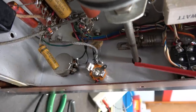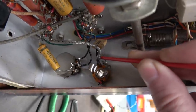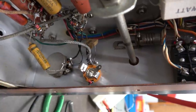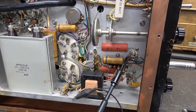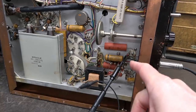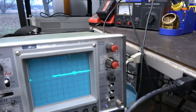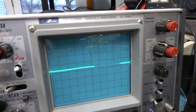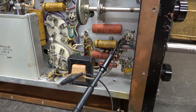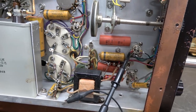I may have discovered why we're getting absolutely no modulation. If you look at this input jack that somebody put in — this over here is supposed to be the hot lead, not this one — and we have a broken ground runner. So this is completely miswired. Remember, when the guy bought this at the swap meet, he was told it worked fine. I've temporarily repaired that microphone input wiring so I can see if there's any audio getting through the section. I'm monitoring on the scope on the primary of the interstage transformer with the old D-104. The signal is pretty darn low. So we either have a bad interstage transformer, or more than likely all the resistors and caps in the preamp section of the Viking 2 are bad — which I find in about every one of them.